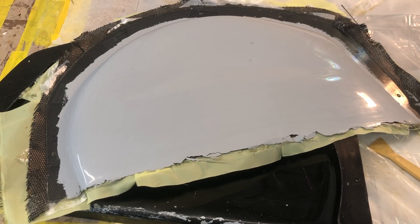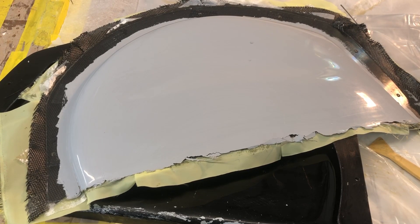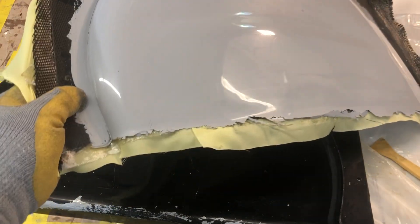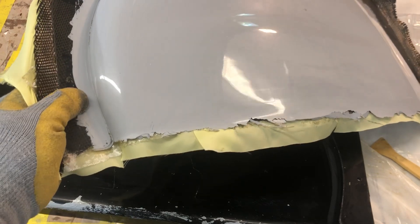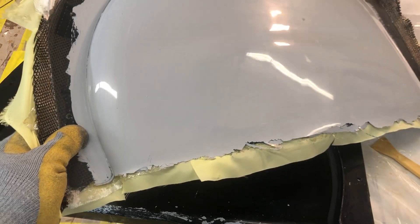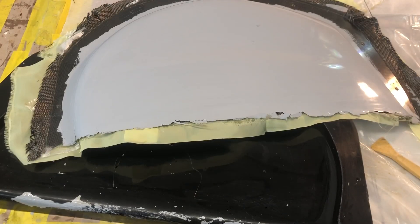In this mold it worked without any PVA — polyvinyl alcohol. It's beautiful and shiny right there. You could even buff it out, put clear on it, looks pretty darn good. Just trim everything, clean everything up, move on to another part — that's the process.